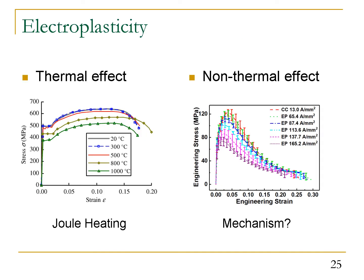We have clearly observed the electroplasticity effect. We know there is a thermal effect — with temperature increase, material flow stress decreases. However, during the tensile test we kept sample temperature constant: same temperature, same thermal heating effect, yet we still see a difference in flow stress. So there must exist a non-thermal effect causing this difference. The question is: what is the mechanism behind this non-thermal effect?